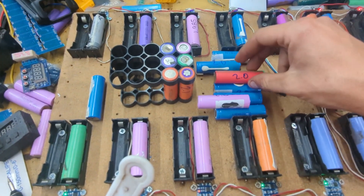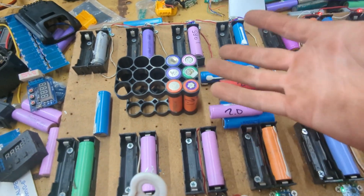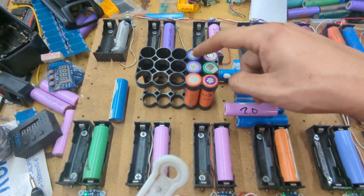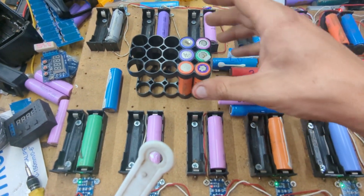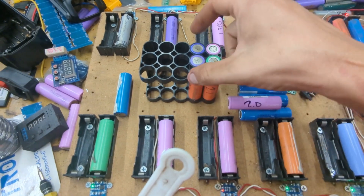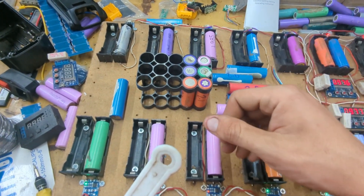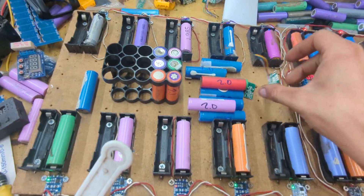The most important thing to know is to keep the amp-hour capacity for each cell the same. Right now I'm picking out all my approximately 2.01Ah cells and grouping them together. Technically, within a parallel group it doesn't matter if you mix, say, a 3.1 and two 1.1s — but the most important thing is to have the same total capacity on each series cell group. Otherwise, when you charge or discharge, the lowest-capacity one drastically fluctuates in voltage compared to the others, and it quickly degrades and damages that cell. That's also why cell balancing is very important, but these PCBs don't really have cell balancing.